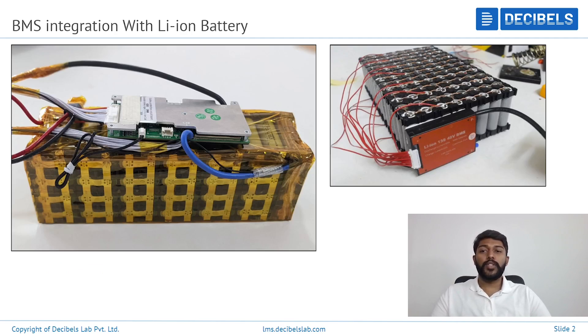The picture you see is currently a battery pack of 13S-4P integrated with a BMS. There are two things when we talk about a BMS configuration. One is regarding the series — 13S series, which you can see on the screen on the right-hand side corner — that stands for your overall voltage.